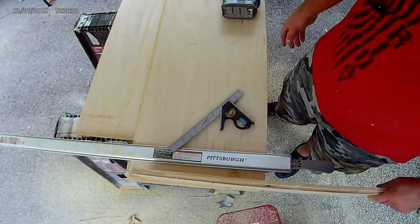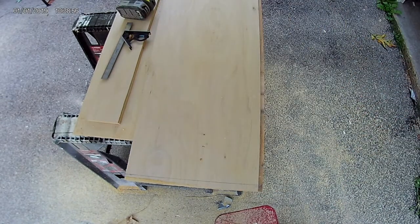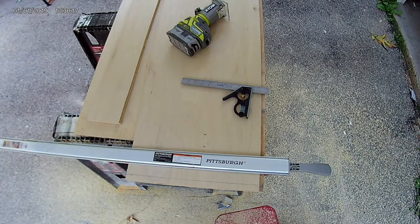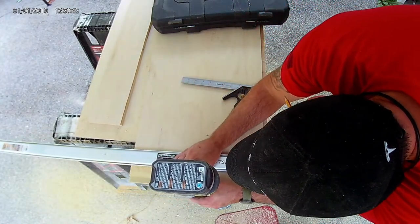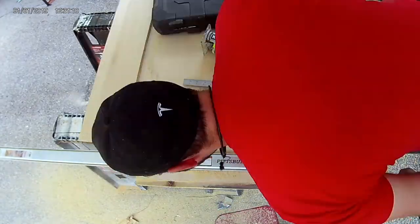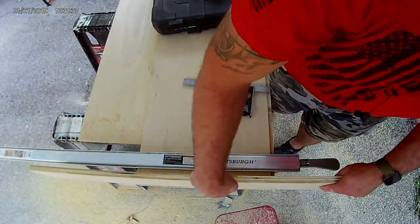Don't rely too much on the wood, because you'll get those circles. They're not that big of a deal, but with wood glue, making sure it's setting up correctly and every part is holding together, you want that surface to be as flat as possible. When that happens, there's no fixing it other than some filler. You could use some Bondo filler, but I just leave it and use brads that crisscross. I'll do one from the side and then one straight down, and that way it's really not going to go anywhere. And then, of course, the wood glue is really going to let it set up and add some strength.